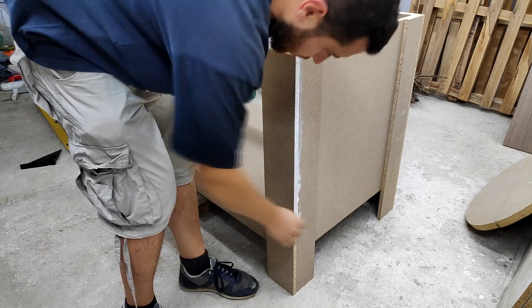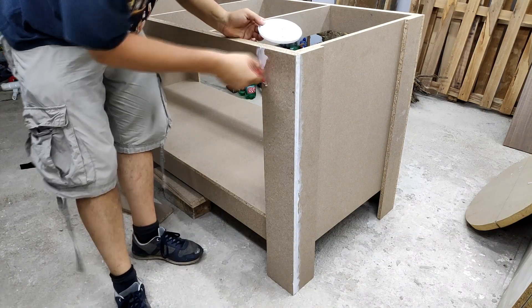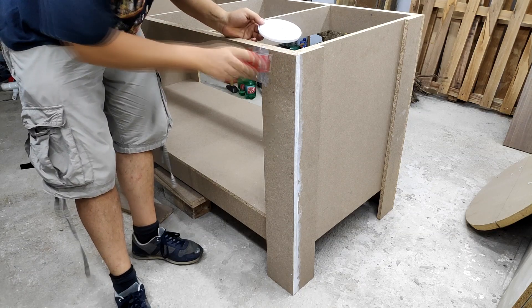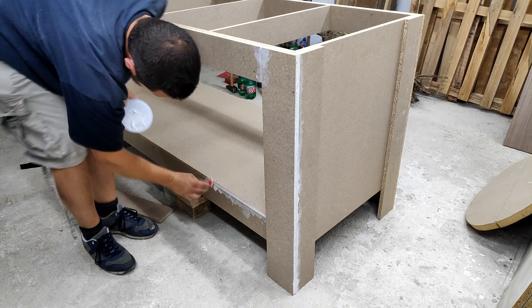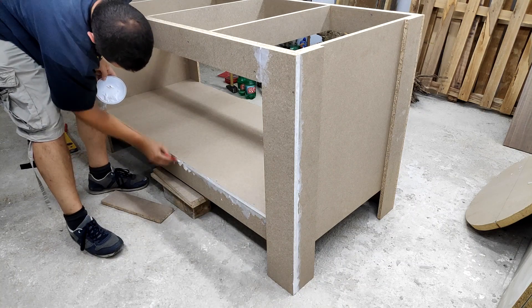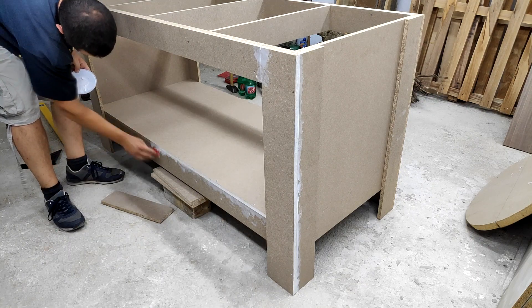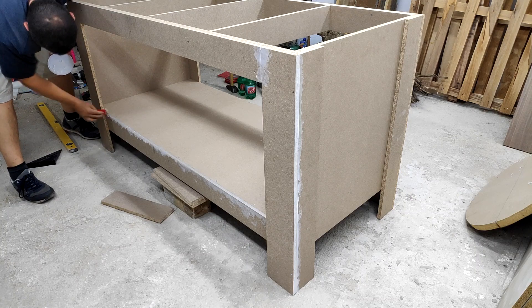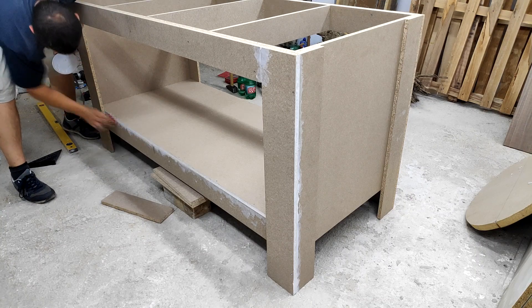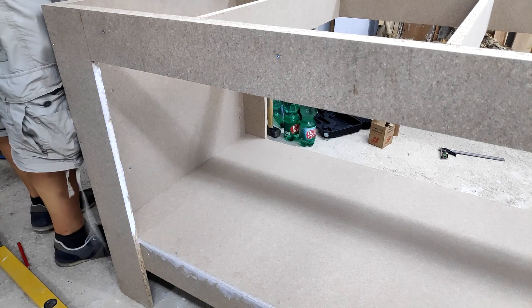At first I was not planning to do any finishing on the workbench and I wanted to leave the particle board exposed just to see how it will behave and how long it will last. However, when I posted the first video about the bench a lot of you commented that the particle board will draw humidity from the air and recommended that I add a coat of paint to minimize this. So now that I was going to paint the workbench I also used some wood filler and applied it on all the exposed edges of the particle board. Additionally I applied it on all of the connections making sure not to apply too much as I didn't want to sand a lot later.